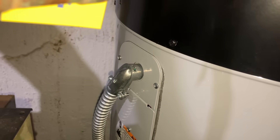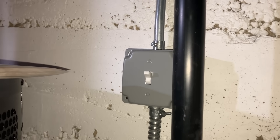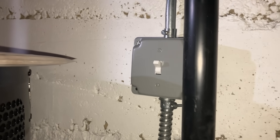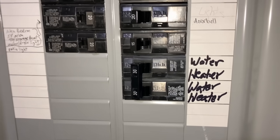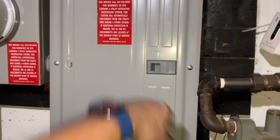The electric: there's our incoming voltage to that disconnect switch — double pole, single throw. 240-volt circuit, 30 amps. Nice conduit, by the way. And then across, all the way to there — fed by a 30-amp breaker labeled 'water heater.' Very appropriate. Not too shabby.